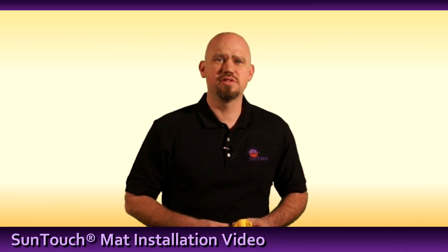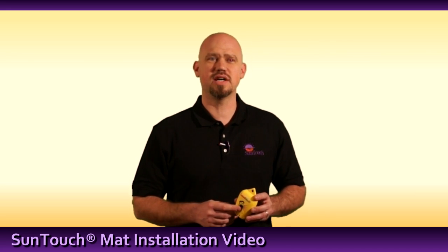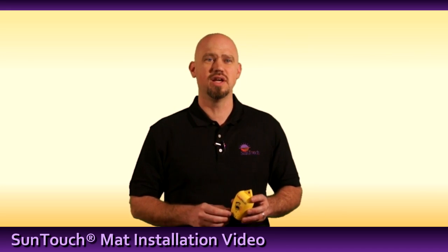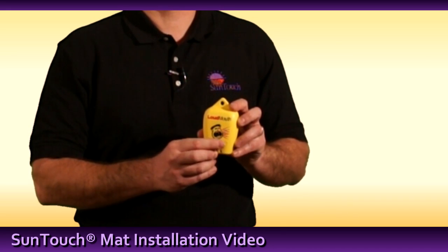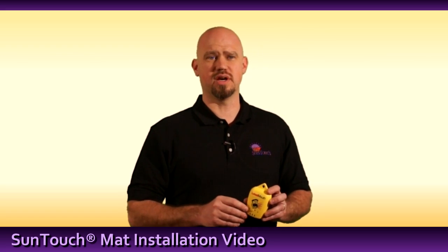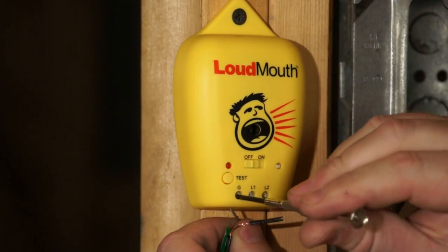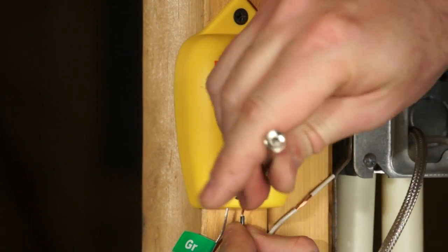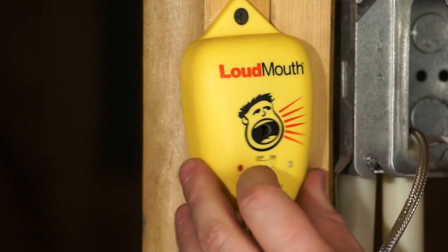The loudmouth monitors the heating wire during the entire installation process. If the heating wire is cut or damaged during the installation, the loudmouth will sound an audible alarm. Repair the damaged area before applying the finished floor covering. Connect the leads of the mat to the loudmouth. When connecting multiple mats, connect them to the loudmouth in series.